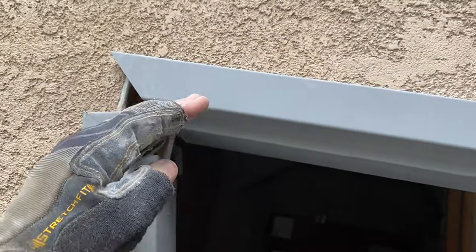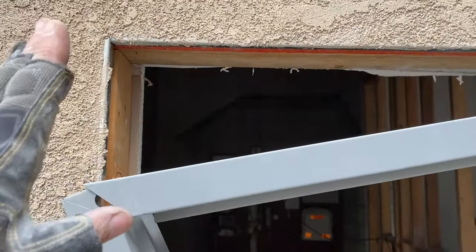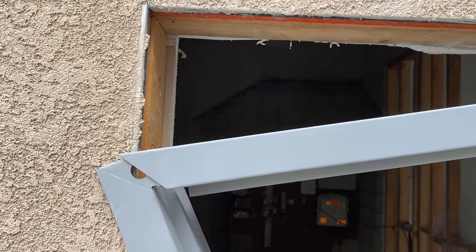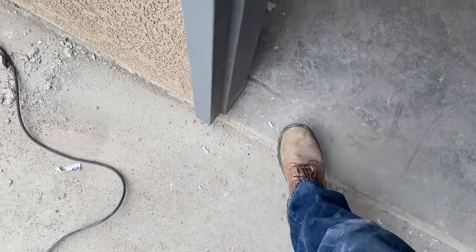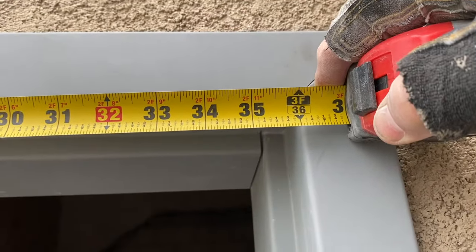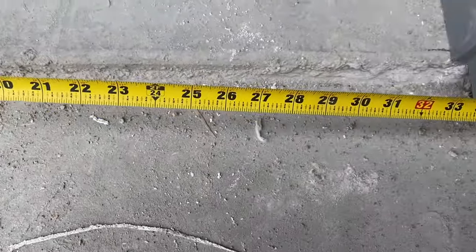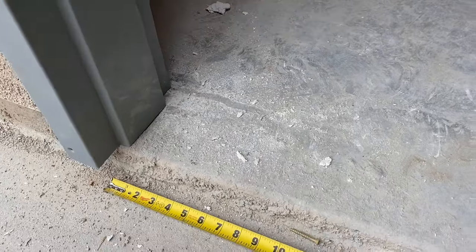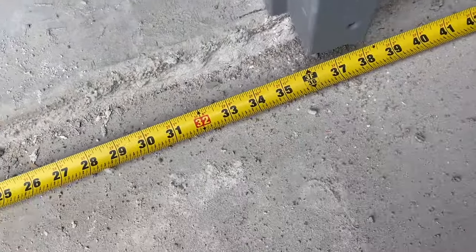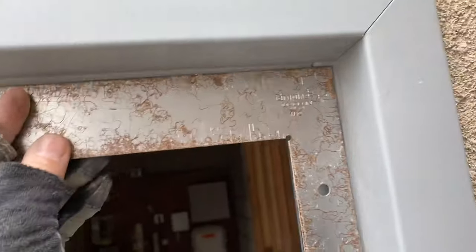I reach it up in there and snap it into the top jamb — sometimes you have to tilt them in order to get them in there. Then you push everything up and that's why you need enough room to do this. Get it in there, then kick it into place just to eye it up. With my tape right there, I need exactly 36 inches. Ideally you want to be able to go wider than 36 on the bottom because you'll need room to move things around since we don't know if anything is plumb yet. I do have the 36 inches — the hinge side is perfectly plumb and the top is perfectly square.